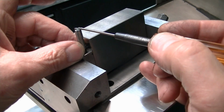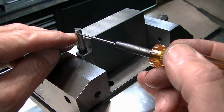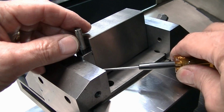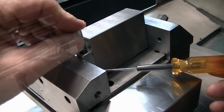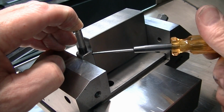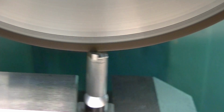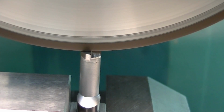I've set my wheel just touching here with the existing tool, but since we ground a little teeny bit off of the seating surface, it'll still leave me a little bit to measure my actual tool thickness. So we will release this, put our wrenches in here in the back, and we'll put in another piece like this. Press down firmly, tighten our 2 set screws, and we're good to go. I've already roughed some off. I've got about 12 thousandths to go. Points down. I need about 2 thousandths to work with. Move over.